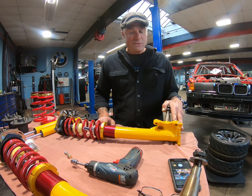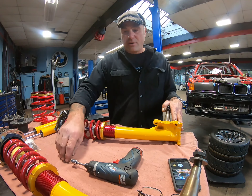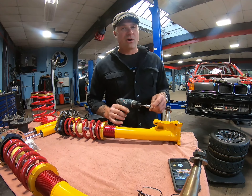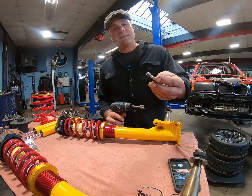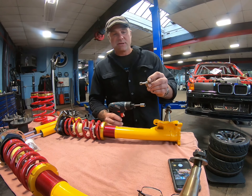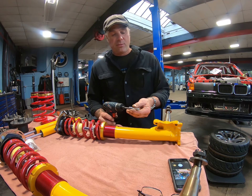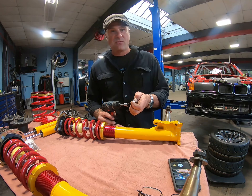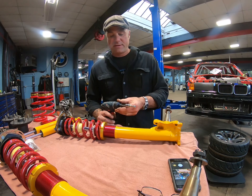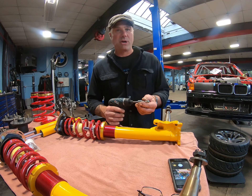What I usually use for this is called a thread chaser. Some guys like to use a thread tap, but thread taps are very high carbon and brittle — they do a lot of cutting, and if you don't get it quite right you can cause more problems than you started with. A thread chaser is something like a tap but designed to clean up threads. It's considerably softer and less brittle than a tap and is less prone to breakage. It has more reliefs in it for dropping chaff out the sides, and I use it on a little electric drill at a relatively low torque so it goes quickly without the risk of breaking the tool.